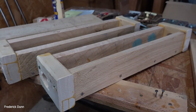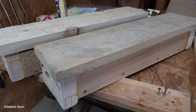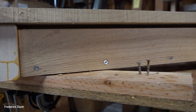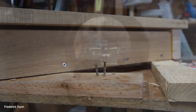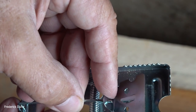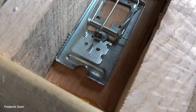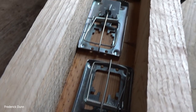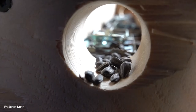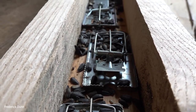These are your tops — if you know basic woodworking you'll be able to build these, scaling according to the trap size you use. Notice the gap on the side: the ends raise the cover a little bit so mice can smell the food inside but can't get in through the side — they have to go through the hole. Once in, they see a row of traps and step on the wide trigger plates. You don't have to put bait on the trigger plate. The way I'm showing it set up is backwards — I actually want the trigger plates facing one another, with a little teaser food out in front.